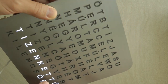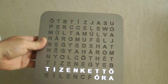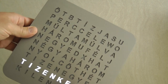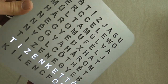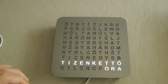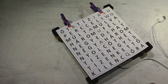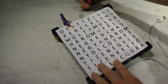The clock face is one-and-a-half millimeter mild steel, which I've laser cut the letters into. I used 150-grit sandpaper to give it a brushed finish, and just spray-on lacquer to seal it and protect it from rust. That would be the introduction — please enjoy the video. I was doing this recording before I fixed the front face, the metal clock face.